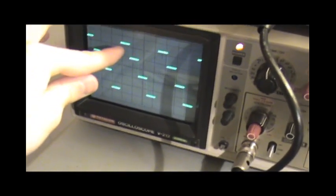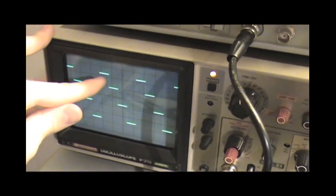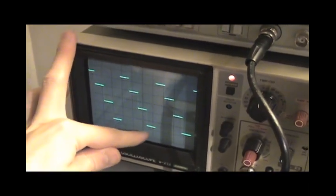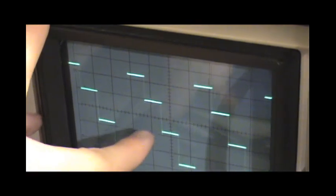That waveform that I was showing, right here, this is at the op-amp output. This is inverted from what I entered. If you recall, I went 0, 5, 10, 15. Or excuse me, I didn't go 0, because if I did, then it would just not play anything, because it would try to loop. It went 1, 5, 10, 15. But as you can see, the highest here, you'd want it to be 0, 5, 10, 15, as in flip vertically.